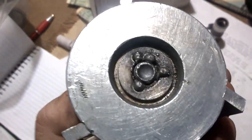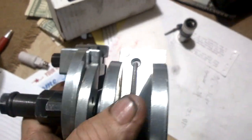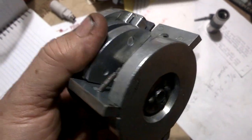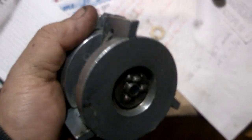Unfortunately, when you try to tighten it, this is an aluminum body and there's a serrated steel insert that's threaded in there, and what happens when you try to tighten it is it pops out. So you can never really get it to ream, because the force of pulling the ridge off pulls the serrated threaded steel insert out.